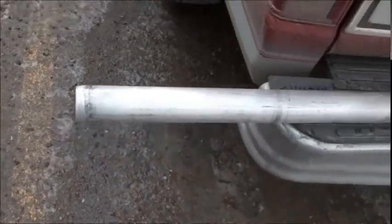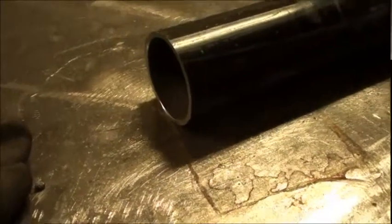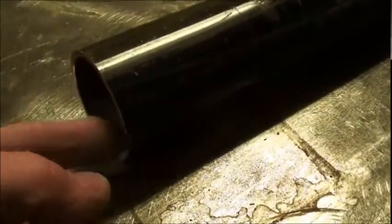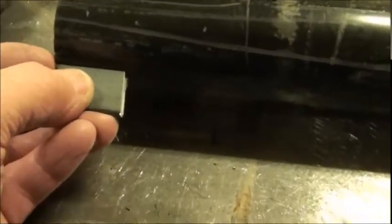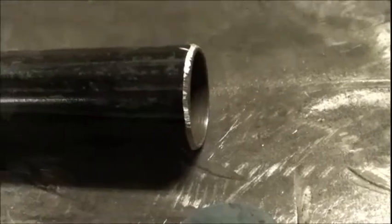I've tried wood stiffeners and sheared them right in half along with the mast. We're making the mast socket right now, and I've beveled the inside edge so it doesn't have a hard edge on the mast. It consists of three parts — we've got this little tab that gets welded right here, and this angle here is 11 degrees, same as the rake of the mast, and this little plate gets welded right there. I beveled that to have a place for the weld to go.